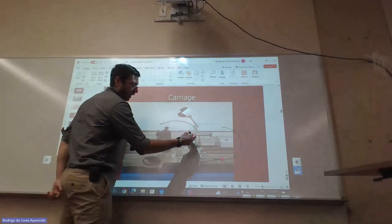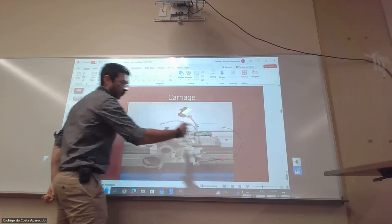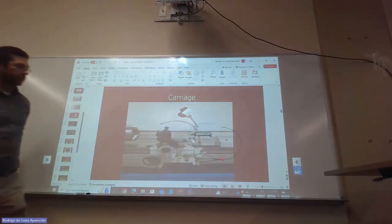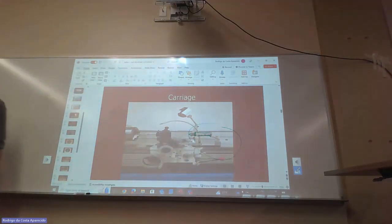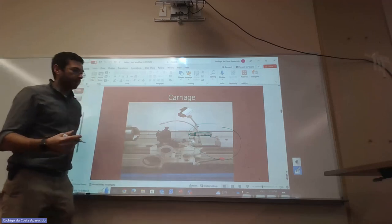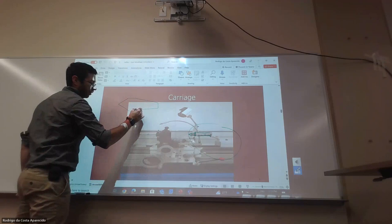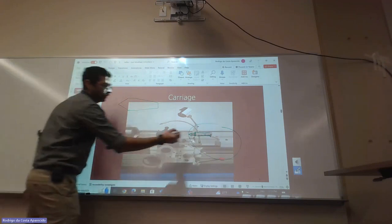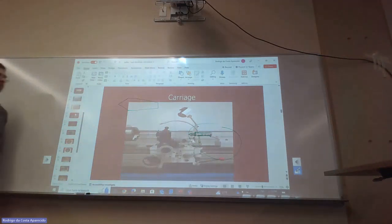So whatever you have here, this tube is actually what moves back and forth, right? It has all the gradings for how much you're moving forward. But whatever you're going to put in here, this is a dead center, for example, but you can put a live center, or a chuck. It's kind of the same. This piece here has a taper on the other end, and inside of that piece you have the same female taper. On our machine, this is a size MT4. Whatever attachment you buy that has an MT4, it's so perfect that it just goes in.